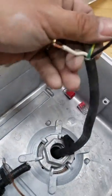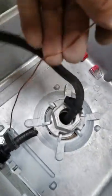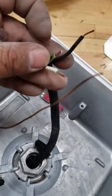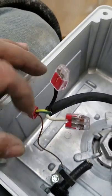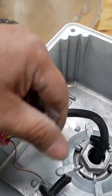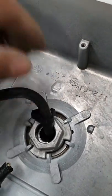Once all the wire nuts are off, you should have three wires exposed plus your ground. Get your wire nuts and attach them — green with green, black with black, white with white. The green and yellow is your ground, and the black and white connect to the next step. The wire on the side is dead, so don't worry about it — just cut it even.